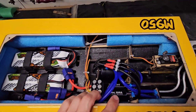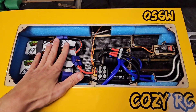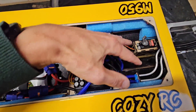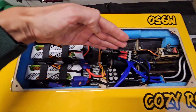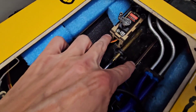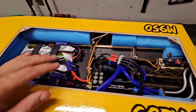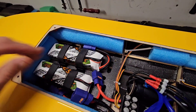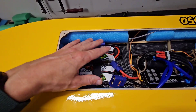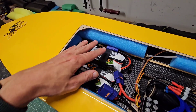Here we have the inside of the hull. Each M series is more or less the same layout-wise, but the M950 has different bulkheads compared to the M500 and M700. It has two big longitudinal ribs going from the transom all the way forward, which also hold the motor mount and support the big lipo tray. There's plenty of space for your lipo setup — it will fit 2×3S, 2×4S, or even 2×6S for a parallel connection.